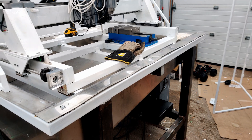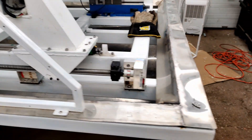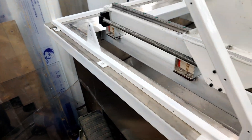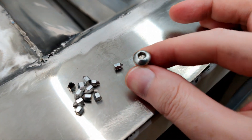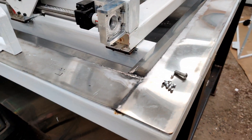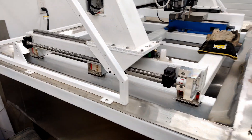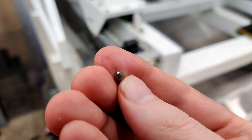After that I got the bolts put in the holes. If you've seen a previous video, I was talking about these little things here — let me grab a bolt. You can see them all along there. The idea is these little things fit on top of the bolt, and that way I can punch a divot in the stainless steel once I've clamped everything down so it's reasonably flat. I went around with a hammer and smacked it — you can see there.